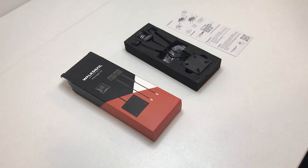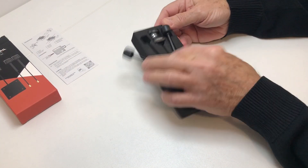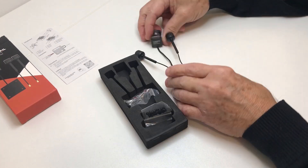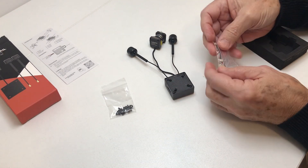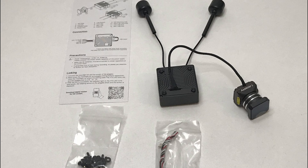The Avatar Moonlight Kit comes with a 2.1mm lens camera. It supports 4K resolution at 60 frames per second. It features a starlight sensor to improve image quality and performance in low-light scene shooting. It has built-in electronic image stabilization and allows gyroflow post-production processing. It also supports manual shutter and manual ISO settings.